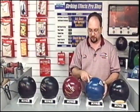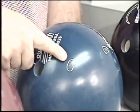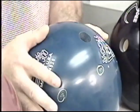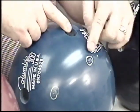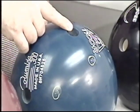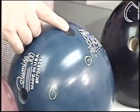Okay, now to the tour boss. Beginning mass bias before drilling was located slightly to the right of the thumb hole. After drilling the three grip holes, moved towards the axis point. With the addition of the balance hole on the PAP, the mass bias moved more in line with the PAP. So this is slightly different than the 8 ball, which started to move a little bit towards the grip.